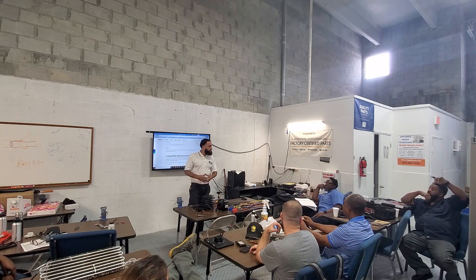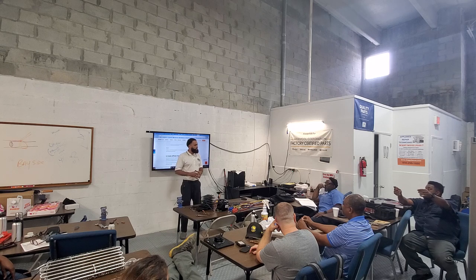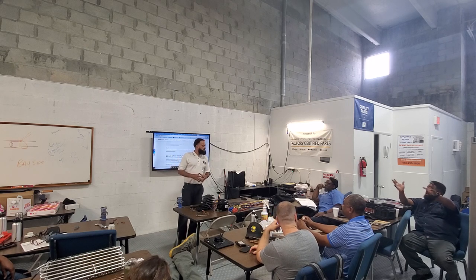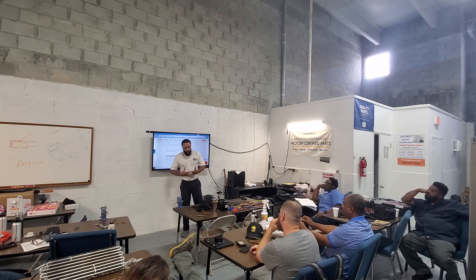We're gonna remove those little black rubber grommets, seals, whatever. What are we looking for? Noise, sound, smell. We hear an audible sound. Is he right or wrong? What I was going to say is we're also looking for the caps on the end of the compressor, the suction line, and the discharge line. Make sure there's no air or debris or garbage in there. Make sure they're intact.